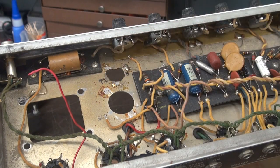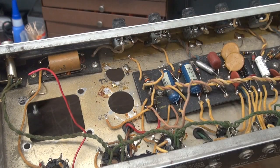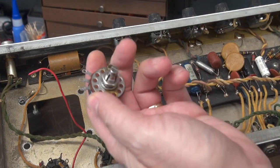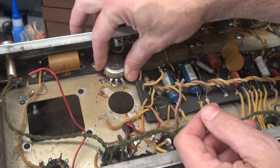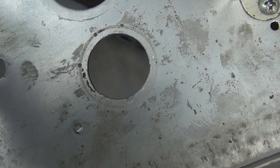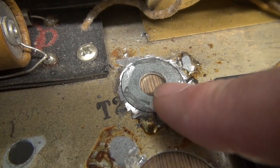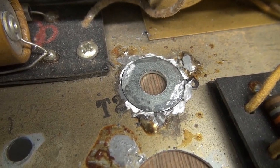I got the caps and the transformer removed. I'm not going to install them at this point because I need to repair this gouged-up hole. I planned to put a bias adjustment in this amp, so what I'm going to do is round that out to where this washer can go into the chassis and I'll solder that into place. I have this beautiful Allen Bradley 10k resistor that, lined up sitting like this, will give him adjustable bias on the Princeton. Got the hole ready for that washer — going to clean the area and flow solder around it, then mount the pot.